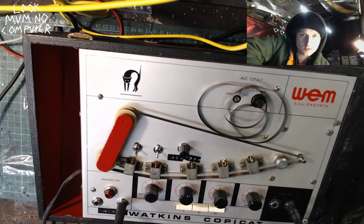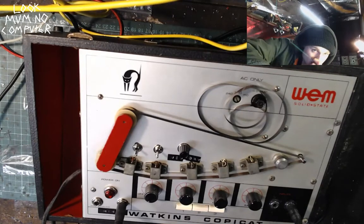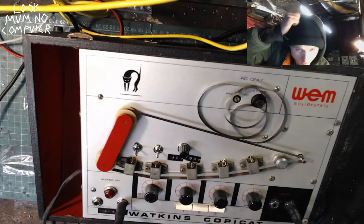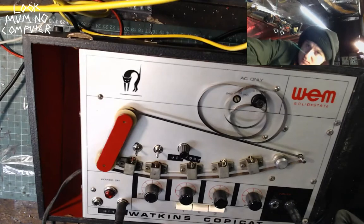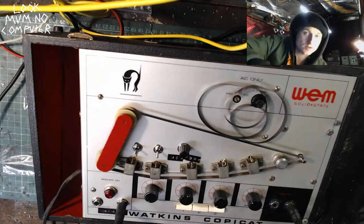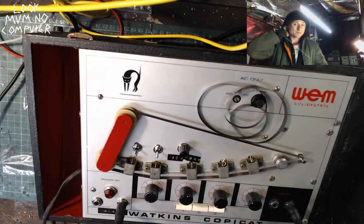What's a 2 diode mod? I'll have a look. As in 2 diodes to add clipping? Yeah, I guess you want to add clipping. Oh, so you rectify it on both sides to cut it off. That basically saturates it, doesn't it? Okay. Well, have a look at the 2 diode mod. There are diodes that do exactly what you say in the MS-20 filter, so if you build the MS-20 filter, it'll already have that sort of diode clipping.